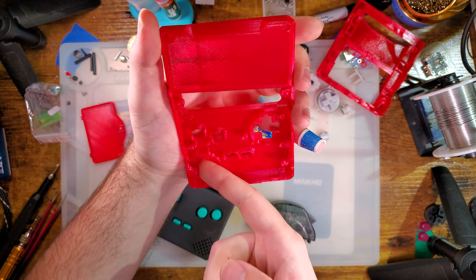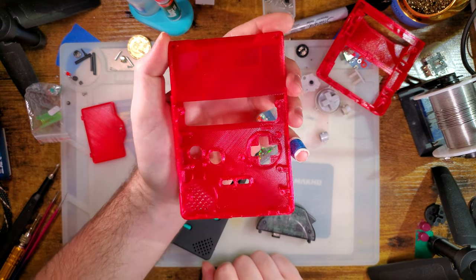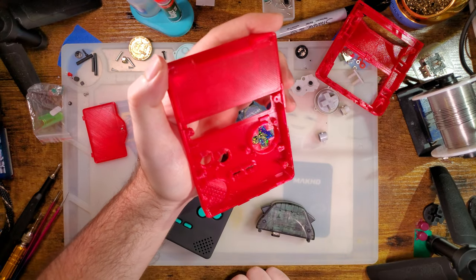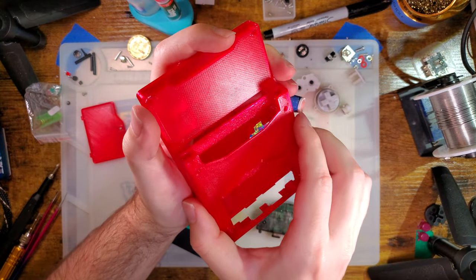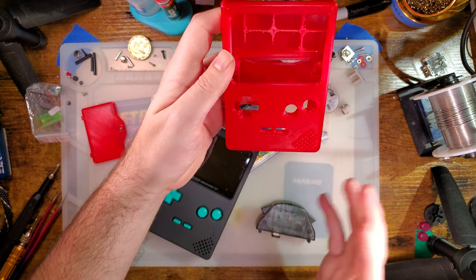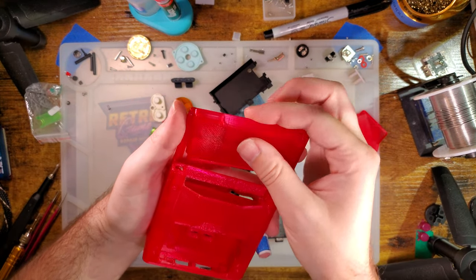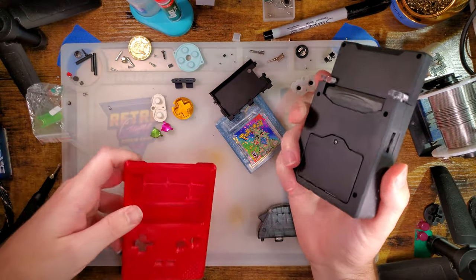From a manufacturing standpoint, these three screw posts are very difficult to do in other materials. 3D printing, it's mostly fine, but injection molding or machining — basically impossible to cheaply machine or cheaply injection mold. I don't know what Zypher's end goal plan for this thing is. If it really is just to make a 3D printable model and throw it on Thingiverse for hobbyists to enjoy, that's totally fine as is. But if the end goal is to have them manufactured, unfortunately that's going to have to change. Otherwise, it's a stark improvement over V1, and this resin print is a stark improvement over whatever I can do at home.